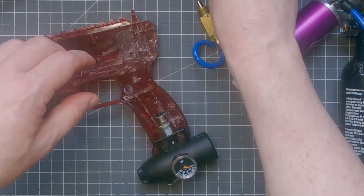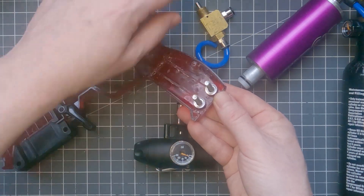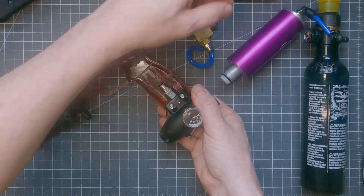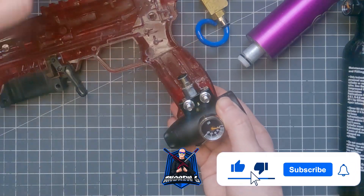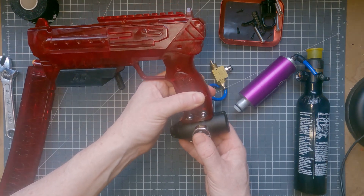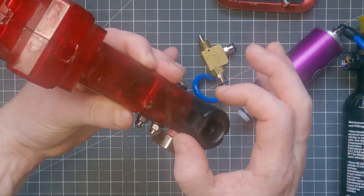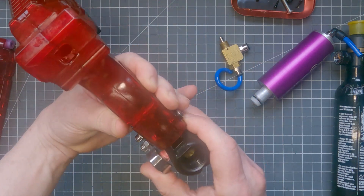So I decided to grab some locking nuts, and by screwing those to the right depth with some nylon washers, then washers again and another pair of nuts, these could hold the relay centered. Then when I pop my dome nuts on, it stops the relay from moving up and down as before, and also removes that side-to-side tilting — each side is clamped by those locking nuts. That's how I've fitted the Empire Relay nice and firm with no wiggle or jiggle at all.